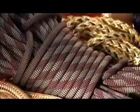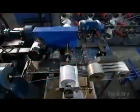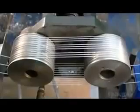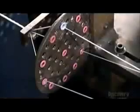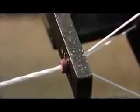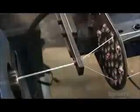These ropes are made from thousands of nylon fibers that are finer than human hair, but stronger. To make rope, yarns wind around aluminum cylinders, pulled by a turning spool down the line. Then, 3 at a time, the yarns roll over another spool that applies a protective coating of urethane. Then they funnel through a distribution plate that holds them evenly apart. This ensures they're at an even tension, as a rocking spool twists them into one larger yarn.